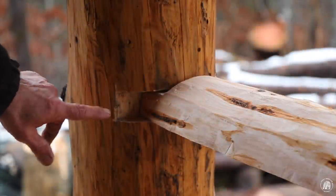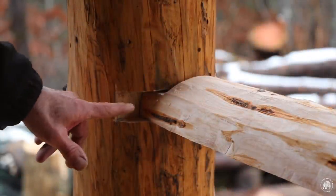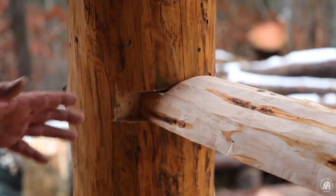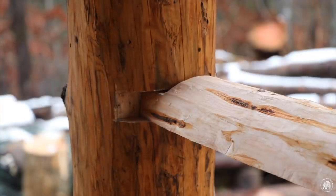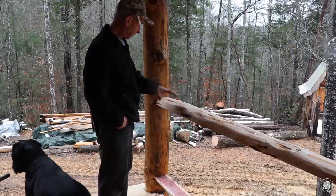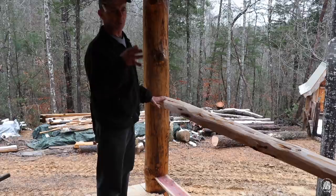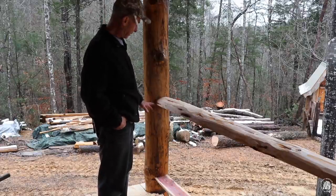This is the easiest type of notch for me. Basically, I set it back in 1.5 inches. I spaced it 1.5 inches, and then I cut it, and then it just slides right up in there. I couldn't really notch out for the curvature of the log and set it back in there because I have both ends that have to go in. It wasn't like the handrail on the end going down the steps. So that was the easiest cut to make.